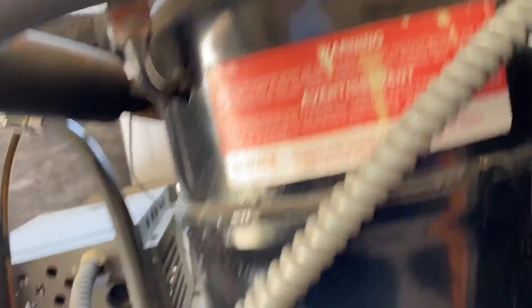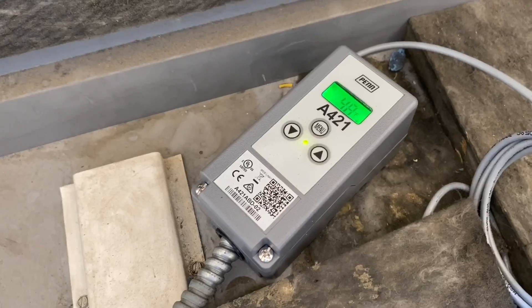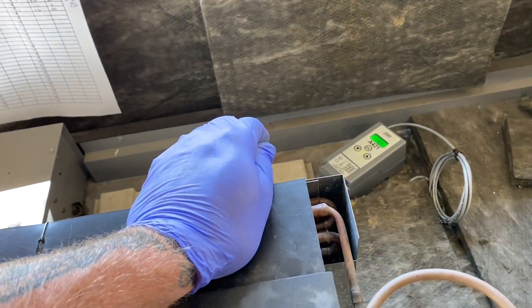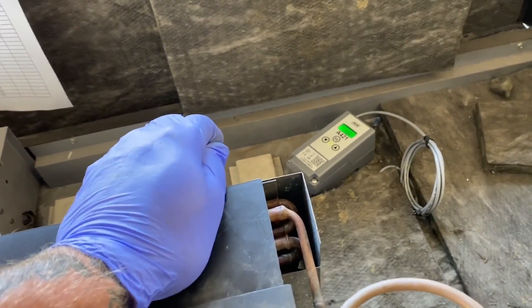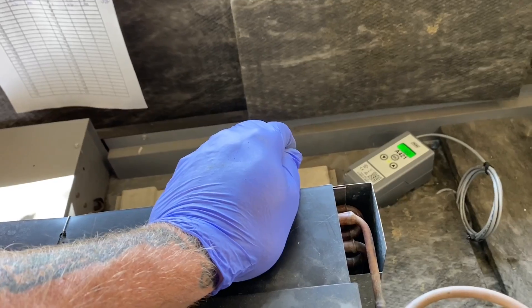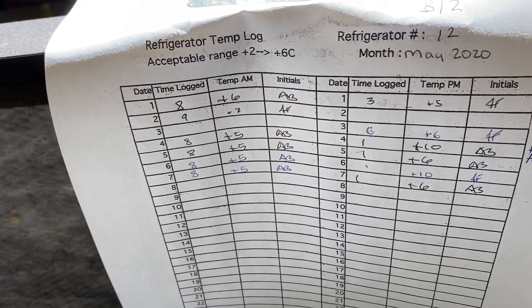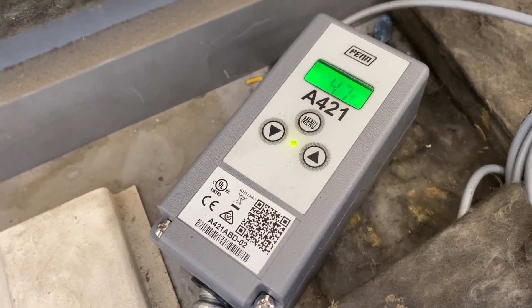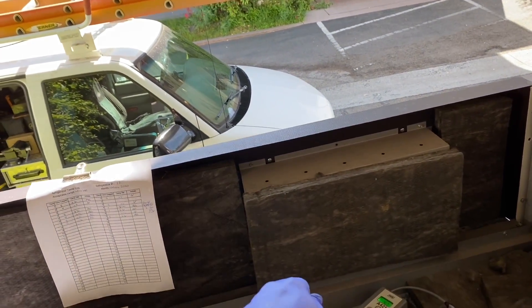That's how the wiring's going to look - about a 19 degree evaporator, which is about right. And this is what it looks like when it's all done. With this A421 ABD02 it has a defrost built in. I set them for every 6 hours, 30 minute defrost. We're trying to get to about 5 to 6 Celsius on these, but I got it set for Fahrenheit - so 38 degrees Fahrenheit off, and then on at 41 degrees.